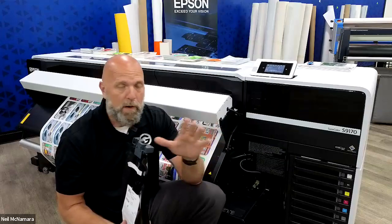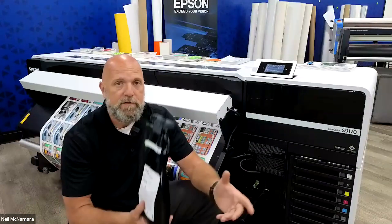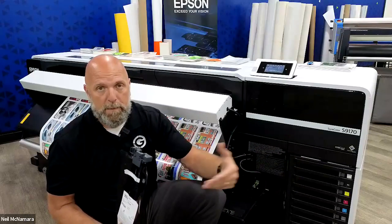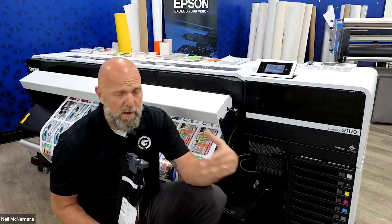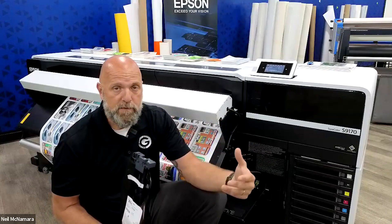All of these parts are available at GroomCo.com. You can check out the pricing and make sure you do the math correctly — you're ordering the appropriate size container. But ultimately, if you have your white ink inside your machine, you want to be printing with it regularly. I would say about 30 milliliters of ink deposited every two weeks for it to make sense.